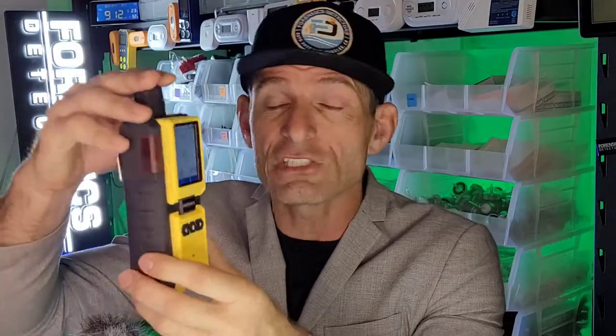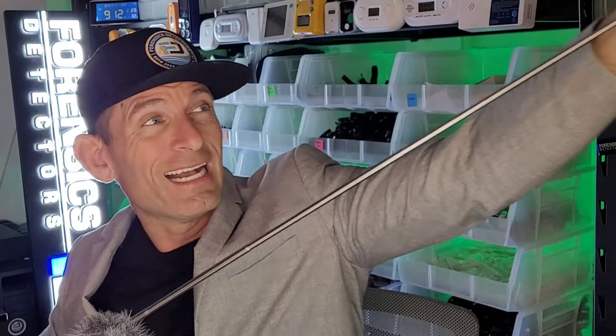It's not measuring percent LEL like some other analyzers — not as sensitive as this one. It features a large color screen, large buttons, and inside has a micro pump that draws gas in to the sensor and displays parts per million. It's designed for analysis and comes with a four-foot telescopic stainless steel probe for pointing and sampling.